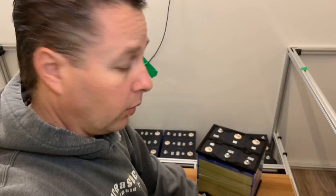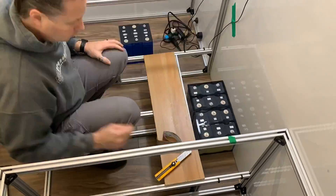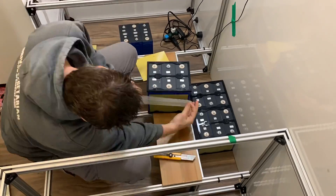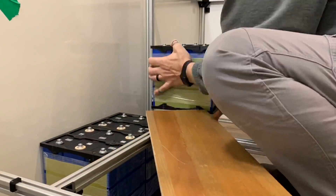You may also be wondering why I placed one of these fiberglass sheets on each side — that will make sense shortly. Though it may seem a little flimsy to use fiberglass tape to hold these together, it's actually what the manufacturer provides to secure and constrain the cells. The thin fiberglass sheets placed between each cell help protect the very thin aluminum casings from rubbing against each other, which technically can short the cells together.